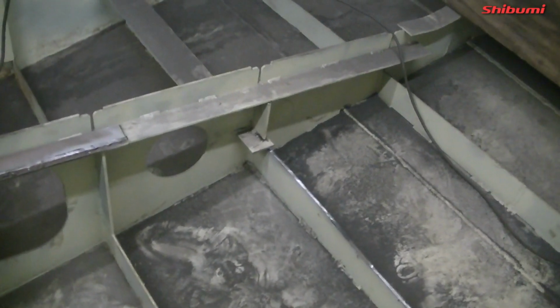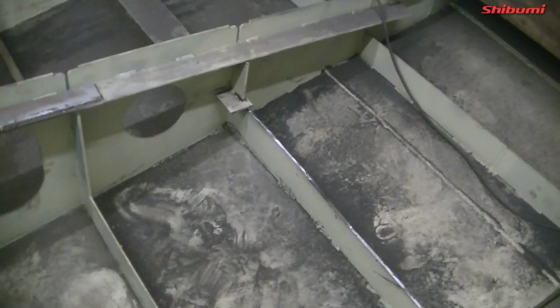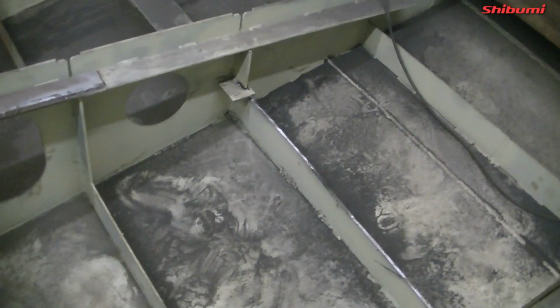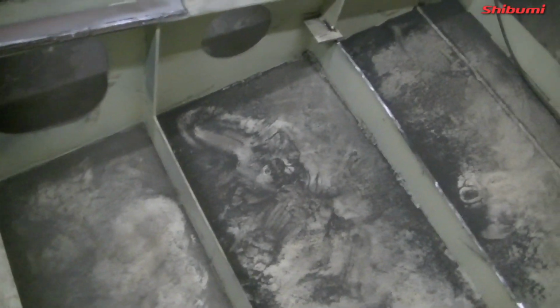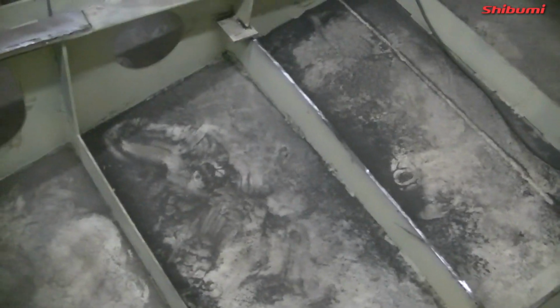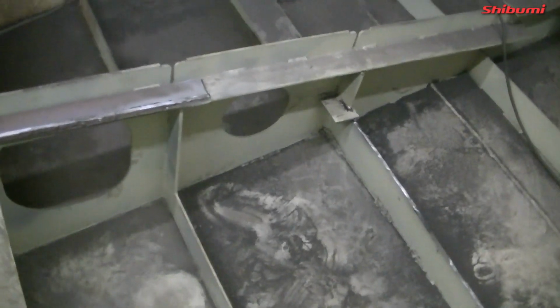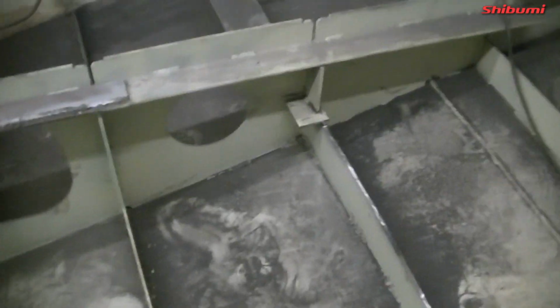So I still have to cut the top strip and get the little piece going up the wall there, and the rest of the actual T-piece on the top. Get that out. This one is okay just to be ground in. And then I can clear all of the floors here and grind them out to bare metal, and then weld all the exterior seams. And then I'm going to make up little plates that will come in here into the sides with a little angle guard on top, lining up perfectly level with. I'll show you on this one.